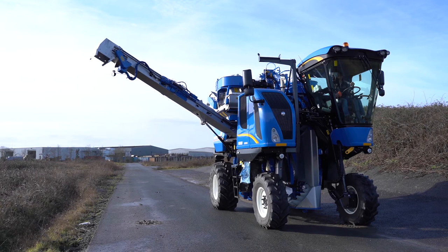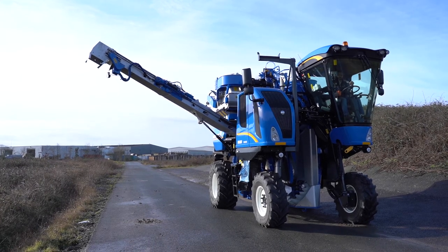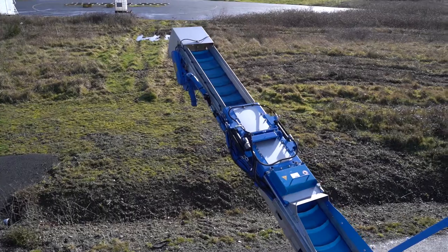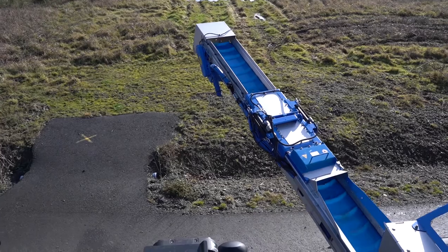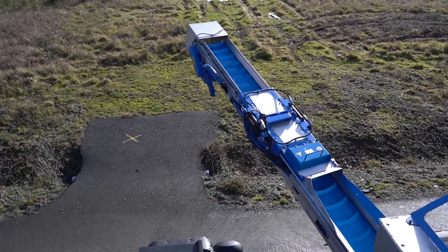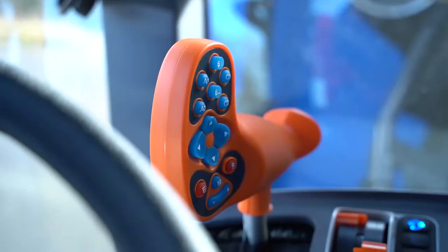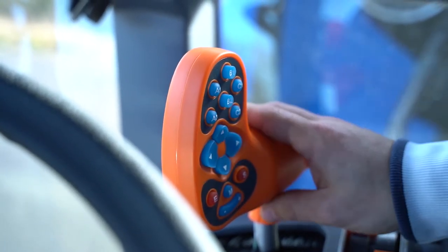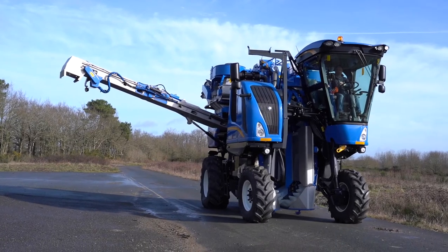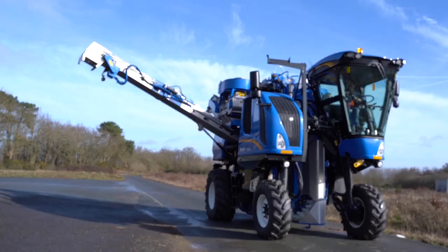Let's take an example. I am harvesting and putting the crop on the hopper. By pressing C2, the transverse conveyor will slide toward the side conveyor, and the side conveyor will move down to its work position. Then, when I want to change gondolas, pressing A2 twice will automatically transverse the conveyor to the hopper and move up the side conveyor to its headland position.